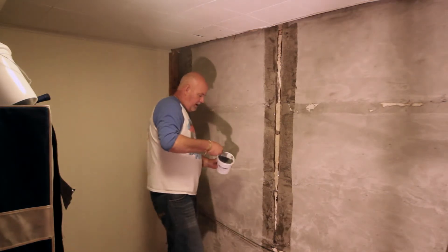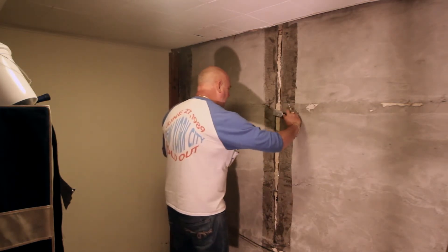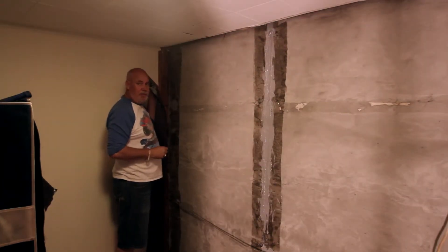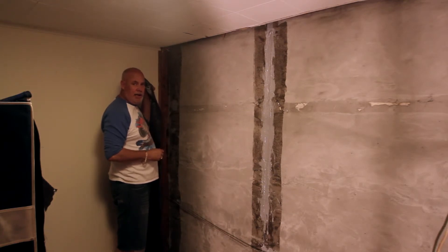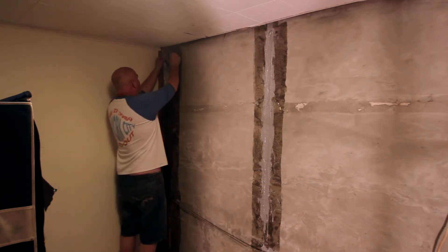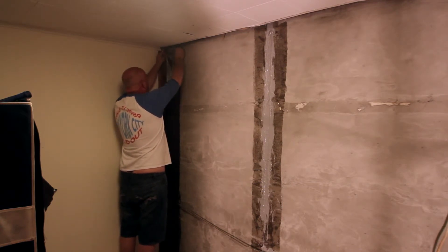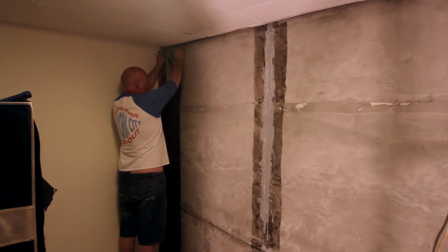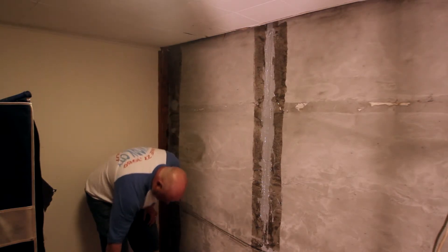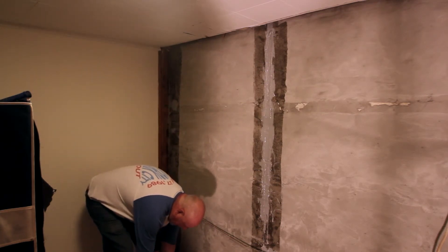On areas where we've got a big dip in the wall, we're really going to have to lather this stuff up because that's going to be a bad problem. We've got our paste filler applied and filled in any irregularities in this block wall. Now we're ready to start putting our carbon fiber strips up. These are six inch strips that I've cut to length. Double check that they're going to fit fine. The first thing we need is the epoxy for gluing the fiber carbon stripping to the wall — it comes in two parts again, part A in the big container.